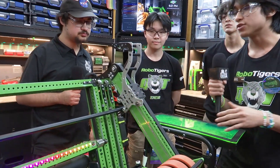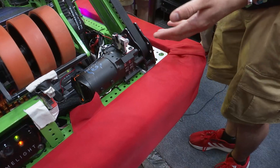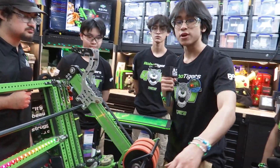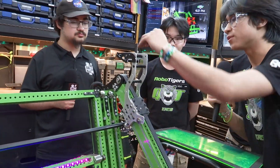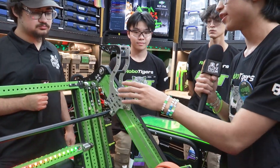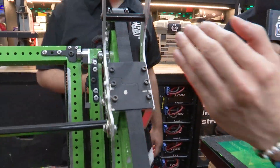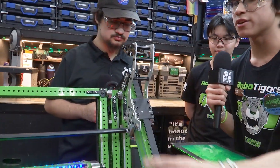So with this sensor, all the way down here is where the programmers zero the entire climb. It's actually magnetic — it uses magnets to determine how to zero the climb. It's also run by one motor on each side, and this top pulley helps with the wraparound. We also have what I like to call a bearing block because it holds all the bearings. In each one of these there are 16 bearings — two types: half-inch bearings on the two-inch side, and 0.625-inch bearings on the one-inch side. This helps with the up-and-down maneuvering motion, which is why you can see the scratch marks.